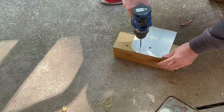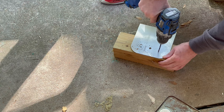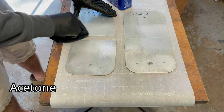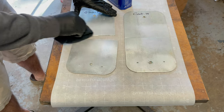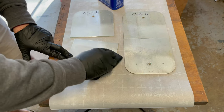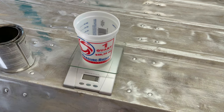Mixing. Stir part A container of coated until uniform consistency occurs. Pour part B into part A container. Sufficient stirring and mixing is the most important step for satisfactory results with coated. Mix with a fold into center motion. Mix entire contents roughly for 6 to 7 minutes. Occasionally scrape the bottom and sides of the mixing container as well as the mixing stick. Mixed material should be used within 30 minutes. After mixing thoroughly, immediately pour material onto working surface. Do not leave mixed material in original container.